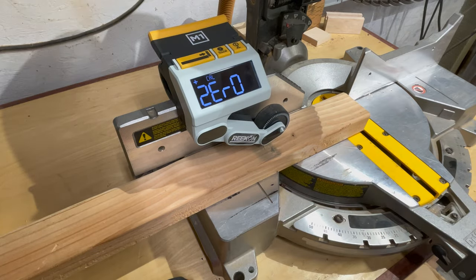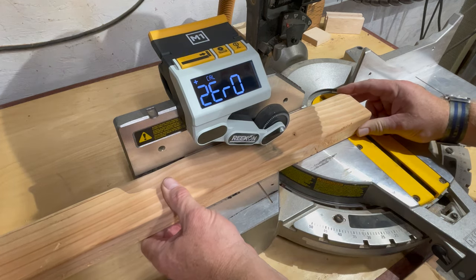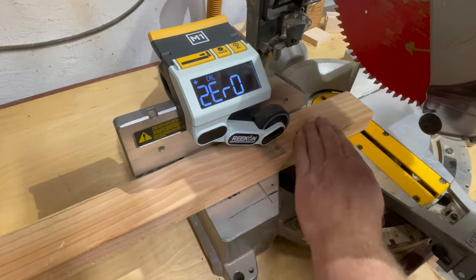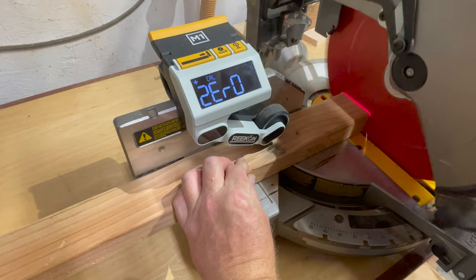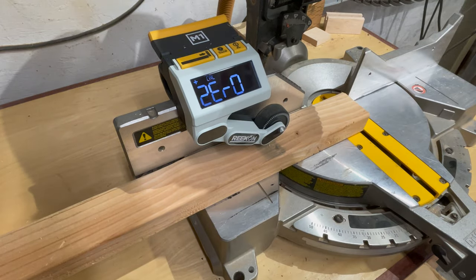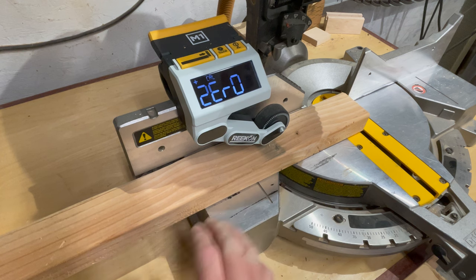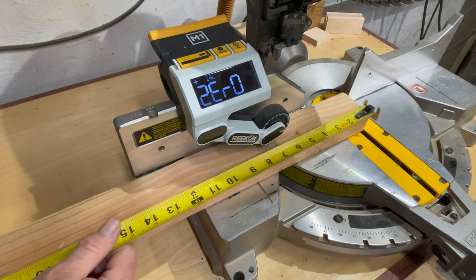Cut the material and select the zero button. So slide the material just past the wheel. What we want to do is square it off. Let's see what we got right there. Looks good. Let's cut that down. Then move the material slightly to the right, ensure the material is stable and saw. Okay, it's already there, so we're good. Now, using a tape measure, make a mark at exactly the 6 foot length. So we will use this tape measure.